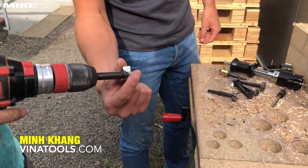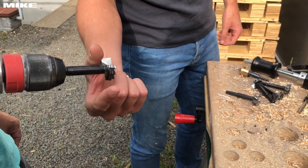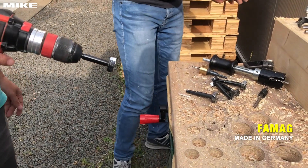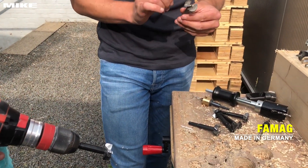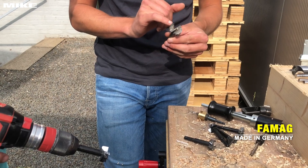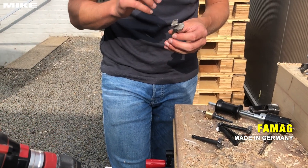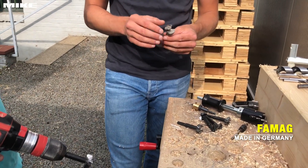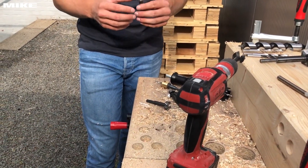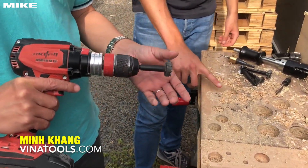So this is a very big advantage — you can feel some heat, but it is okay. If you would do this with force, you would see a very fast blue line at the corner here, on the upper line — meaning the heat was too high. And the sharp teeth will get damaged. Now you will see the difference, especially here in plastic-coated material.